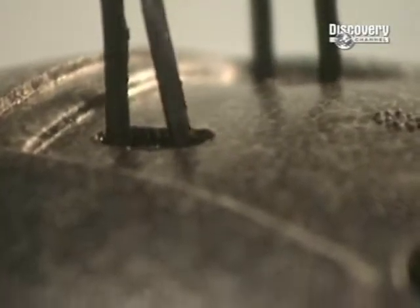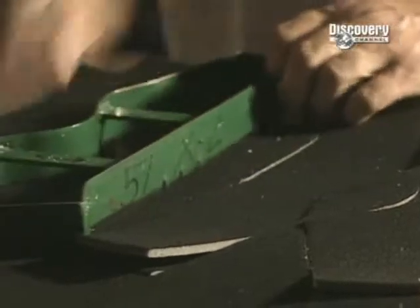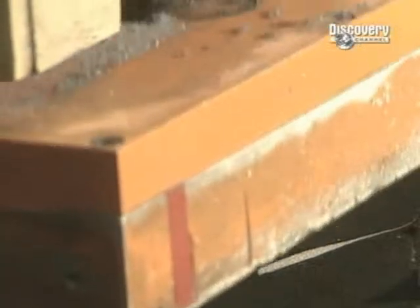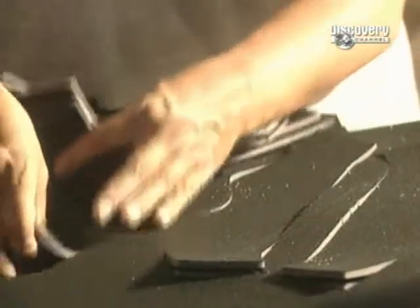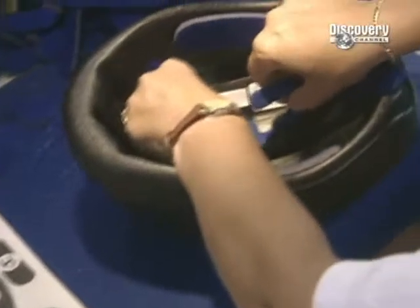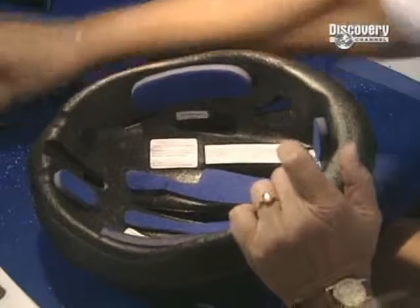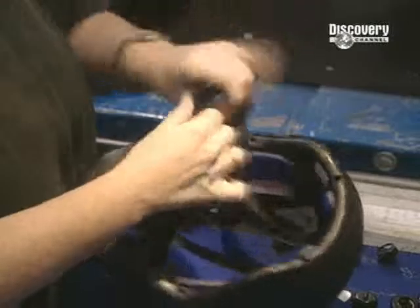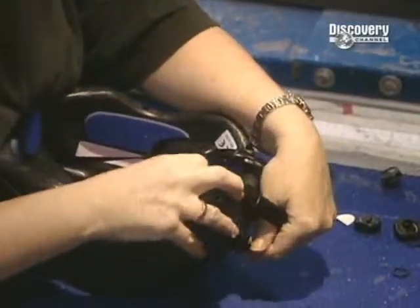Depending on the helmet model, openings have to be made with this heat iron to allow for installation of an air vent. All that remains is to make the adjustment pads, cut with this press-powered stamper. The adjustments are held in with Velcro to allow easy adjustment of the helmet. Inserting the straps calls for good manual dexterity and takes only a minute.